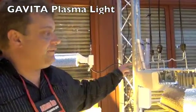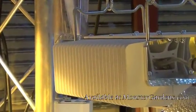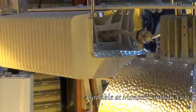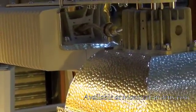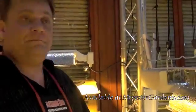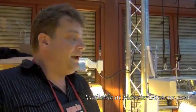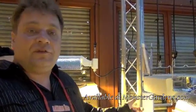Also, you see that we have a lot of cooling ribs. I can tell you that electronics don't like to run hot. Electronics like to run cool. So we have a big heat sink, so we make sure that you will have a long life on this product. Cooling electronics is the most important thing. If you have a heat sink that's too small, your electronics will run hot and the lifetime of the electronics will go down. You want to use a product for at least 5 years.